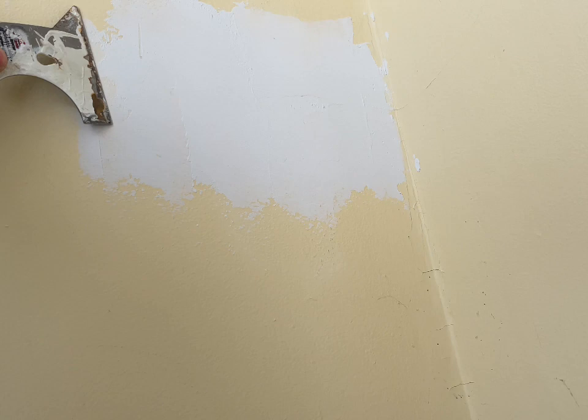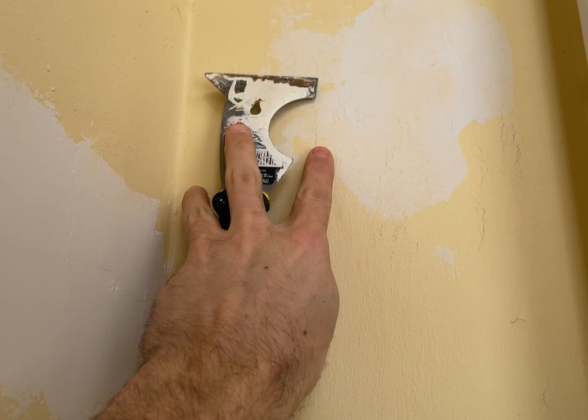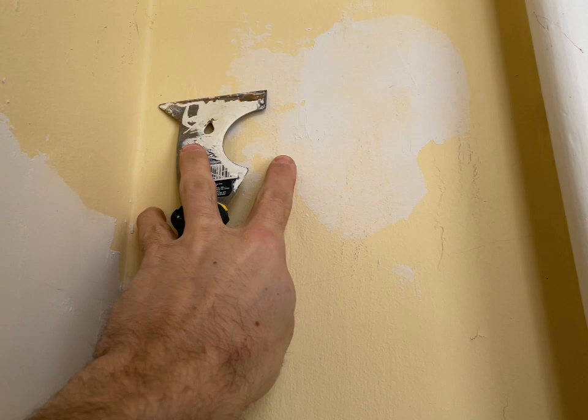One of the things I wanted to include in the videos — you guys have asked for more technical parts of this renovation — is just, once I've plastered and patched, I'll walk you guys through that process as well. All we're doing is filling voids to make it as smooth as possible and getting the best finished product. This one is very light, so instead of sanding with sandpaper, I'm just going to take a damp sponge and knock down all the high spots and feather the edges into the other material, and that'll clean up really nice.